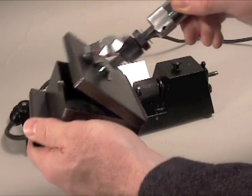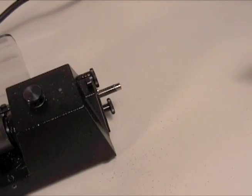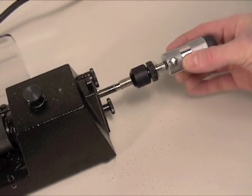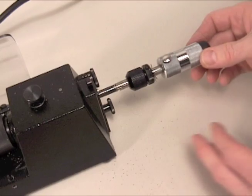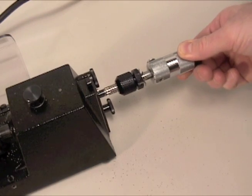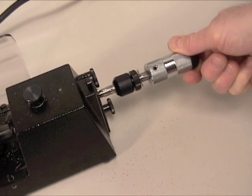When called on to service a lockout on a tubular lock, use an HPC tubular pick to pick all 7 chambers at once. Then a new key can be duplicated from the HPC tubular pick. Place it on the shaft instead of an original key. The depth stop pin will read the depths of the feelers the same as the depth of a cut key.